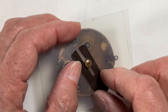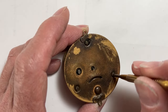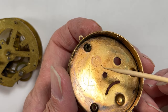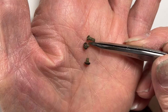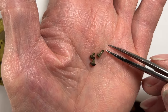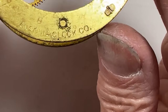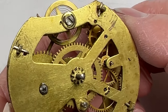Using some steel shims to further protect the case, pry the knob off. Someone has scratched what looks like a bee here — could be Bill, Bob; hope it's not for Butcher. The three back fastener screws are mismatched. This longer one with the small head matches the other case screw; someone lost one of the shorter back screws and used one of the longer case screws — not a good sign. The only markings on the movement is this Ansonia Clock Company stamp, and it's a nice gold gilt movement.